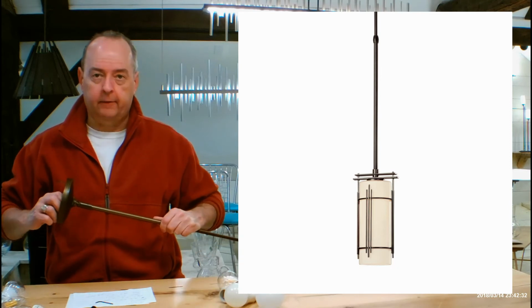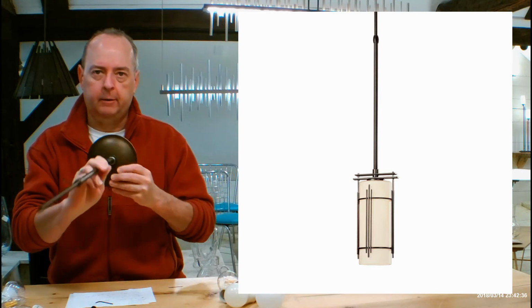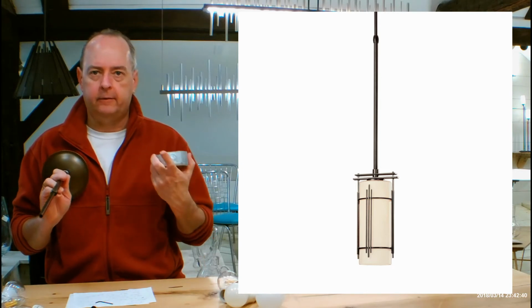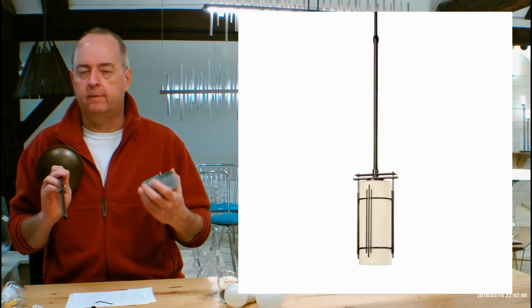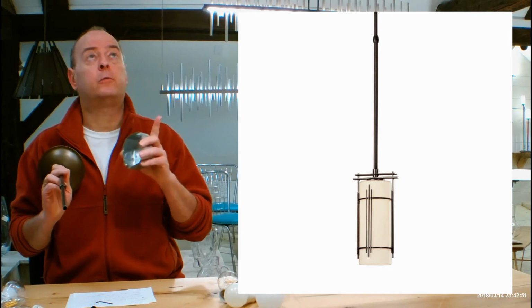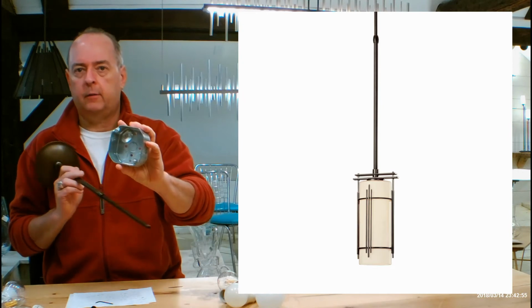The other thing is on that page, you're going to see other details. 5-inch round canopy that's going to go over your 4-inch junction box. If you guys have recessed lights up there that you're taking out or want to take out, there is a product on the market called the Can Converter. Just Google it, go to its website and check it out. Converts those hi-hats, recessed lights into junction boxes, and without a lot of time, money, or mess involved.